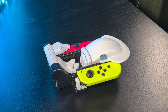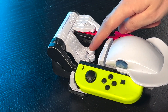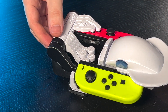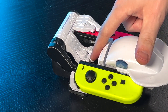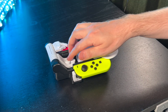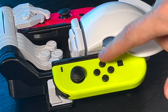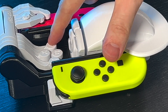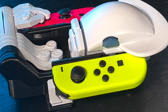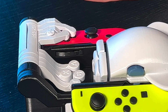I'd like to ask for your comments because there are a few issues I'd perhaps like to fix in a future version 2. First, the face buttons: the arm pushes on the respective button on the controller's side, but because of the distance and U-shape, there is some flex. These are not infinitely solid — it's a bit mushy. Where a normal button stops solidly after activating the action, these ones keep going a little bit. It's fine to play with but could be nicer. Apart from making these out of metal, I don't have a good solution. Is there a way to make these more rigid?